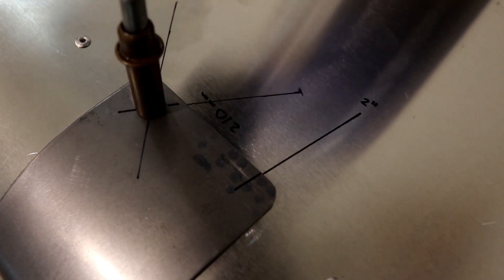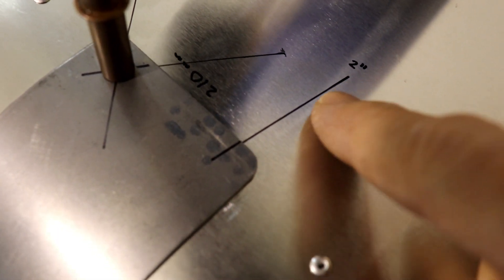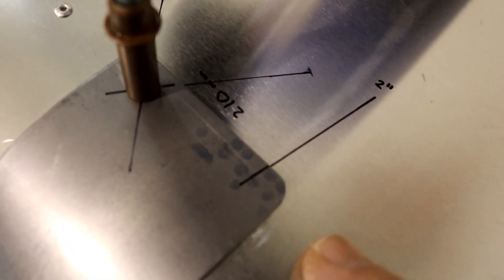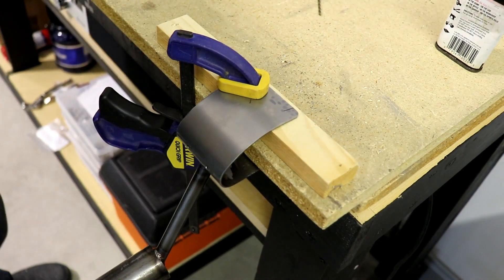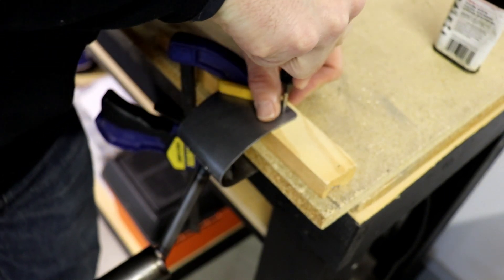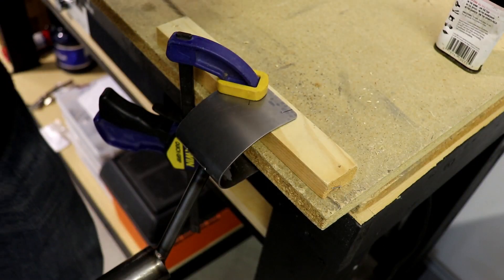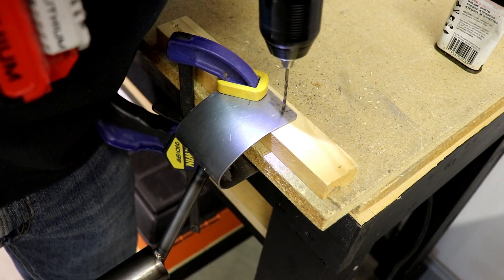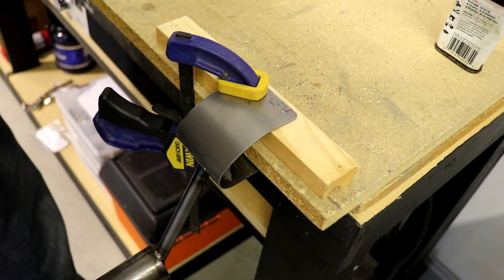Here's what I did. Here's that two-inch line that goes under the counterweight. I put the ruler back on there and measured up two inches, and where that line ends, if I use the center punch and punch a dimple right on the end of that and drill a hole, it should go right into the hole in the flapperon. I have it clamped down here again, I'll take my center punch, put it right on the end of that line. Then I start it with a number 40 and drill it with a number 30.